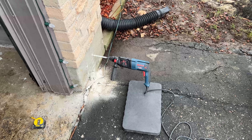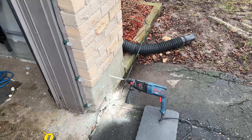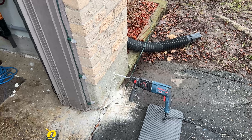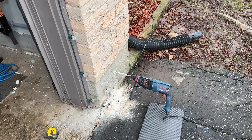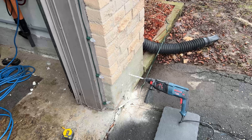This might not be the process for all of you, but we've decided to run our lines through the foundation wall so we can mount inside. Even though the box is designed for all-weather purposes, I'd still rather have it inside - it'll stay more conditioned in winter and summer and you're limiting water infiltration issues. We started with the smallest bit and moved up through sizes. The cable is just over three-quarters of an inch, so we bought a one-inch bit to get it through without any issues.